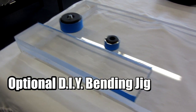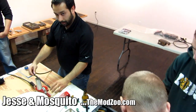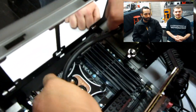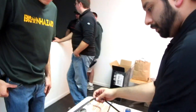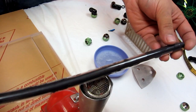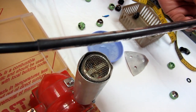Jesse and Mosquito ended up using the bending jig just once and did all the bending freehand. Mosquito used the inner tubing to help visualize the bend and length. One important tip: when trying to get a clean bend, make sure you heat up more area than you actually need to bend, because you don't want the acrylic to experience temperature shock. Make sure everything is heated consistently.